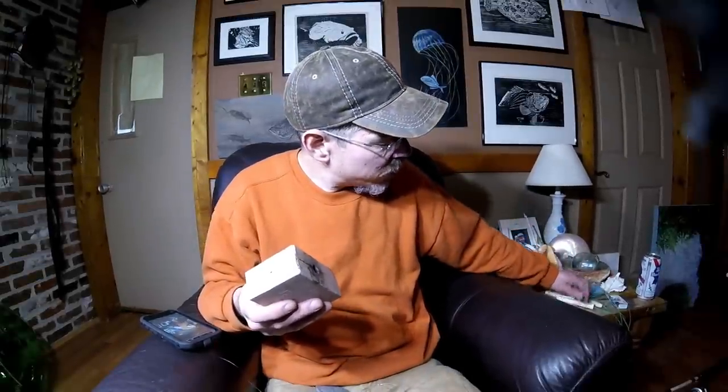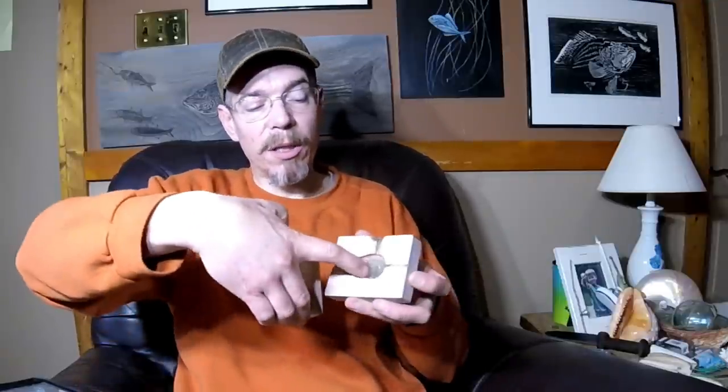And it kind of makes sense because the first one I poured, it was just drawing moisture out of the surface of the inside of the mold. So like this cavity here, drawing moisture from that. After the third, fourth one, it was drawing moisture from the whole block. Right? Another thing I did kind of discover is that a larger mass to the block will keep the temperature down, I think. I mean, in theory, it makes sense to me, in my mind. Keep the temperature down and keep that moisture from drawing out.